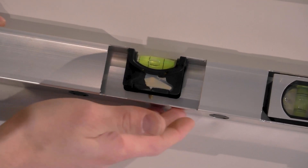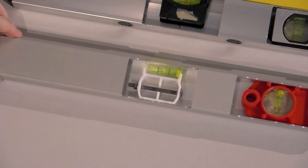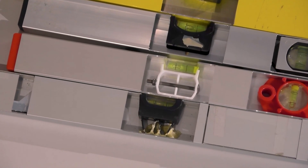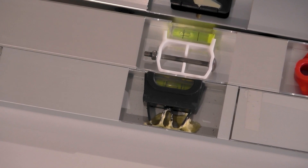It's not connected to the measuring surface itself. Then there is a third system found on the market: a screw. With this screw the vial is calibrated into the profile, but there is tension on it. When temperature changes to high or low temperatures, the tension releases – and because of that there is a deviation in accuracy. And the fourth highlight: some manufacturers just use construction foam at the bottom for fastening the level.